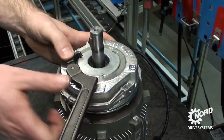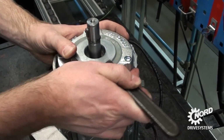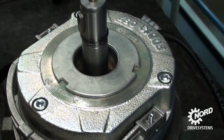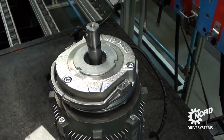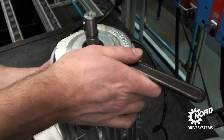It is important that the 3 notches in the spanner nut are aligned with the 3 bolts on the brake before starting to count your clicks. If you are unsure whether the spanner nut has been adjusted previously, turn it all the way to its original tightened position and adjust the necessary number of clicks from there.